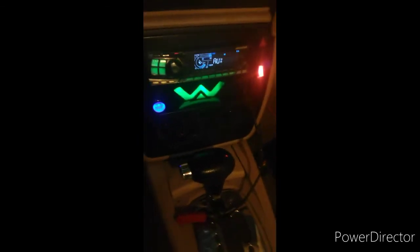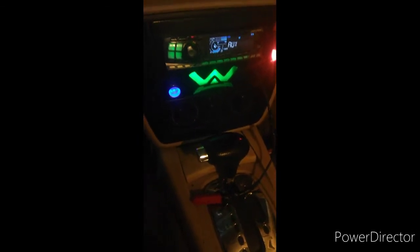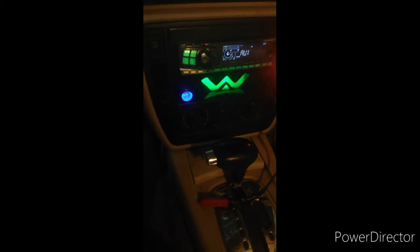Give us an update here. I just finished getting my lights. I think I gotta take care of my switch though, because I wired my switch up with the 12 volt. Then I used a car charger I took apart and soldered in between the switch and the LEDs, and then I added a resistor for overall 4 volts going to the LEDs. But I've got 12 going to the switch and it's a lot brighter. But yeah, I think it came out pretty neat.